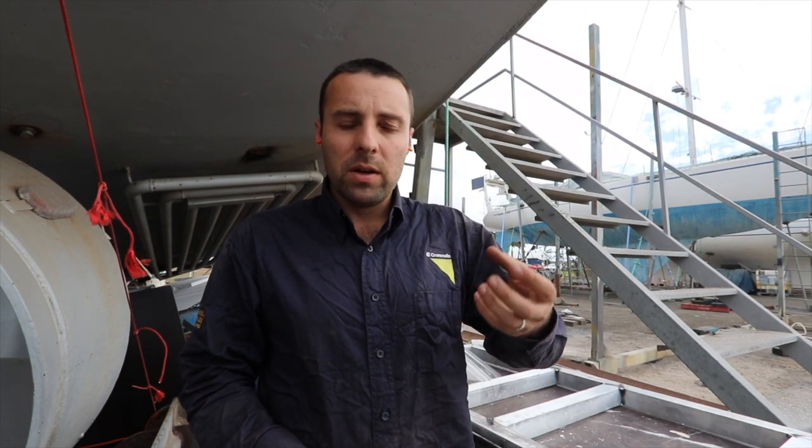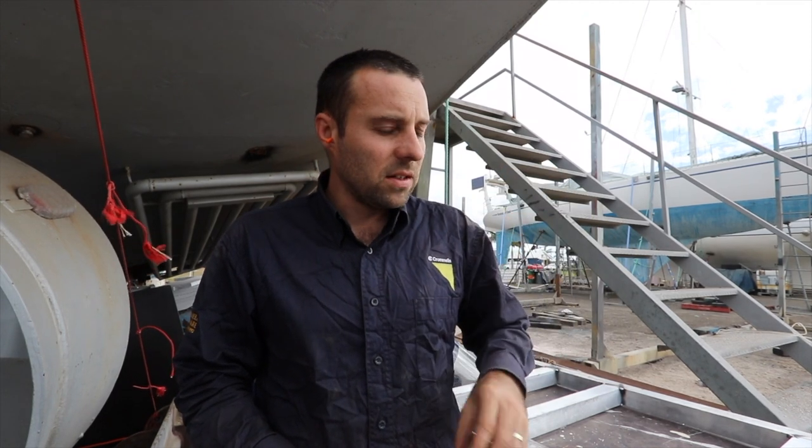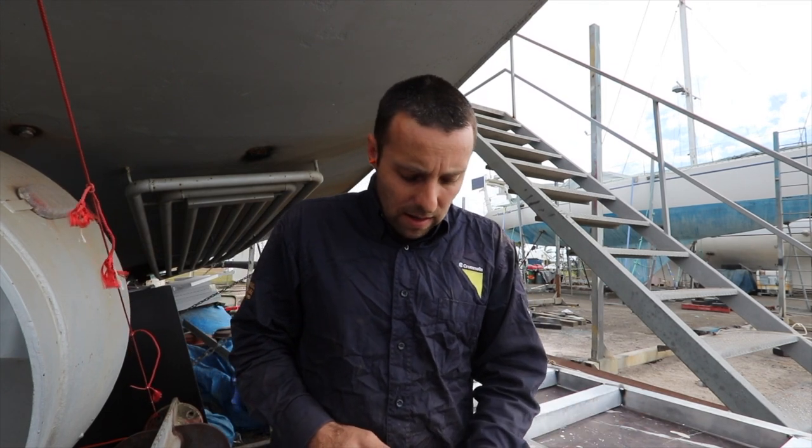Now you do need to put a wax on the blade, otherwise the aluminium starts to melt and really, you know, go onto the tungsten tips and really start to gark up the metal and things like that. Put a bit of the wax on, cuts absolutely beautifully. I don't know what the stuff's called, I haven't actually got any. I've just been using a cutting fluid because it's Sunday, so I can't get any today.